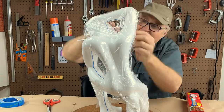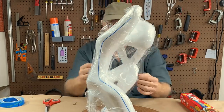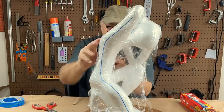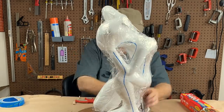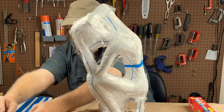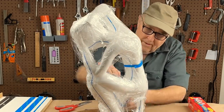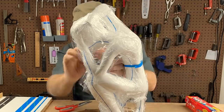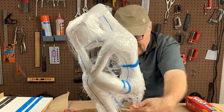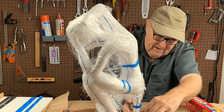It's not going to be the kind of mold that we would make for a small object, because that would use way too much rubber, and it would be very hard to cut, very hard to handle, all these bad things. So instead, we're going to build up the rubber mold out of clay. I'm going to cover the figure from top to bottom, from head to foot, in a sculpture of clay, and that clay is going to represent the rubber mold.